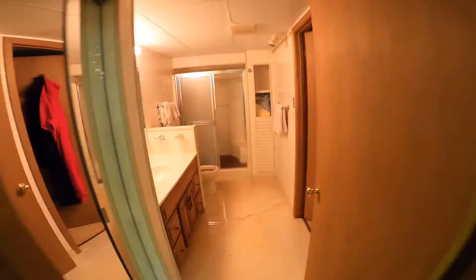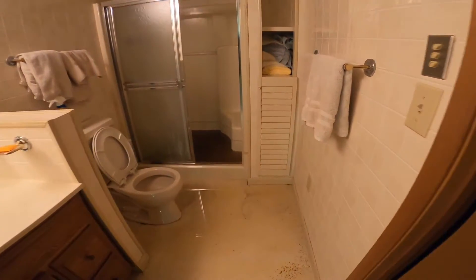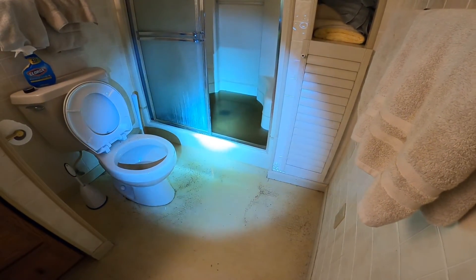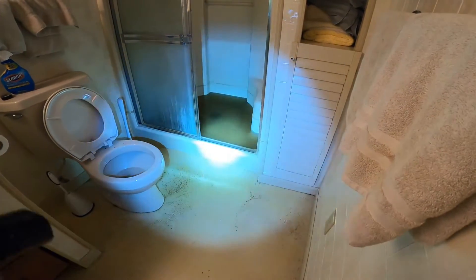Where the water is coming from is the shower stall. You can see the water standing in the bottom of that shower stall — this is our lowest fixture, and you'll notice it's not draining down whatsoever. So the very rudimentary test of just operating the drain piping has revealed a potential issue with possibly the septic tank. It could possibly be some of this cast iron piping too.